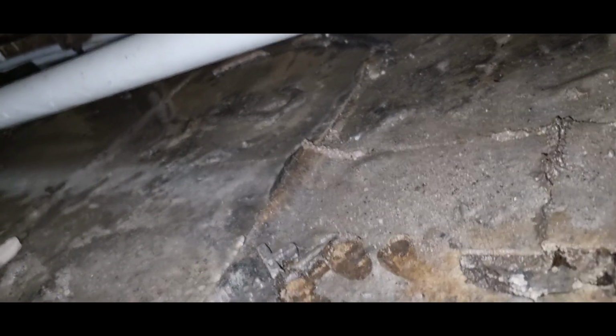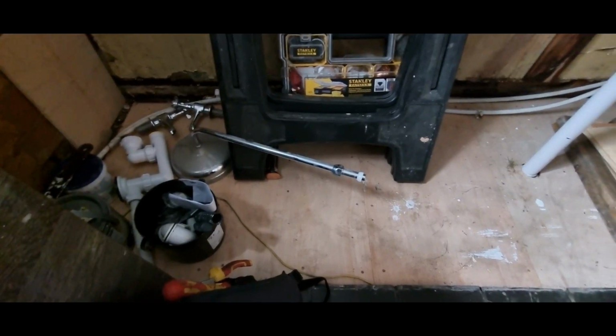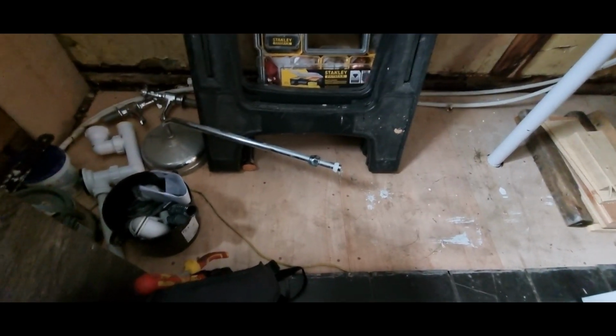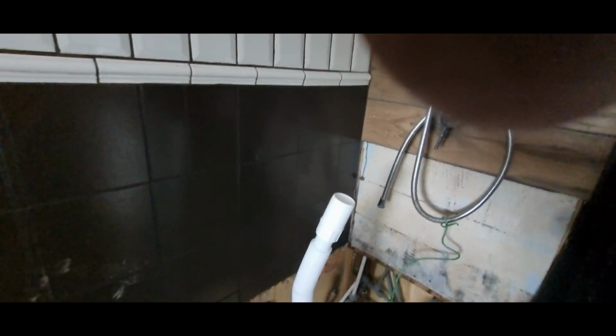Holy shit. What we had to do is rip the floor up, well, for all the rot anyway, replace all the floorboards and put 12 mil plywood on top of it so it spreads the weight out, so it's nice and solid now. What I'm going to do is, just for the record, take some damp readings from the wall. Now, let's go on the outside.